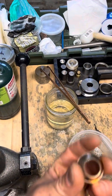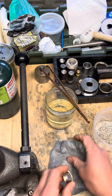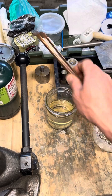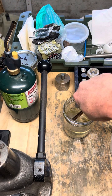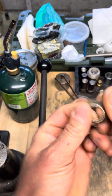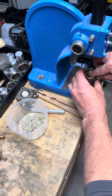Let's go ahead and sand that cut edge down. We'll anneal again and then use a 17-degree die. This is our 17-degree die here — it's got an exterior part, male and female. Then we'll go ahead and open her up.